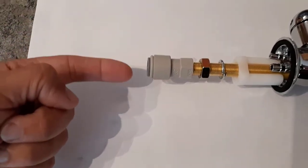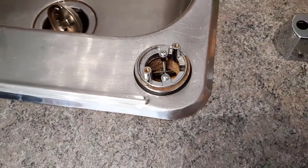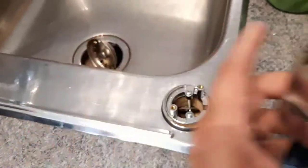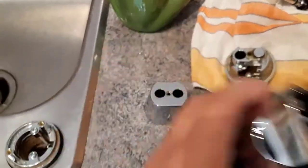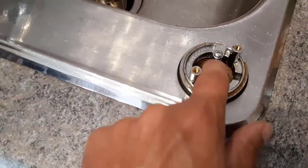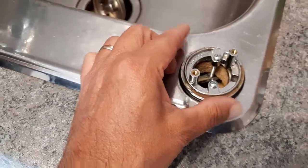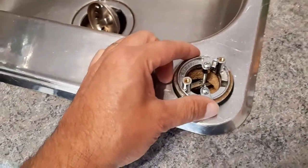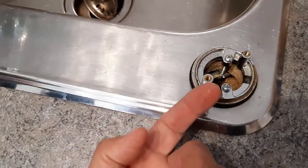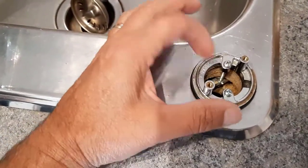And when you install the plastic tubing, you just stick it in there and it'll lock in place. I didn't install this Culligan water faucet, so what I did was I took the screws off the top and this pulled right out of the hole. What you have here is a couple of anchor-type screws that hold the mount of this faucet in, and it's going to be different from the new one. There was no nut and washer at the bottom of the hole under the sink — so this is how it comes off; it's just anchored.